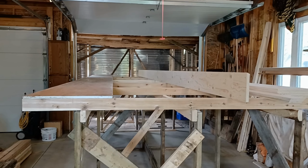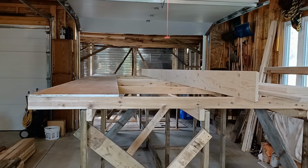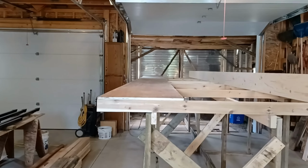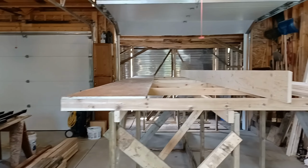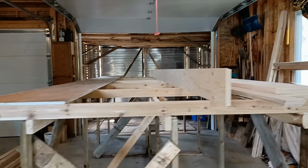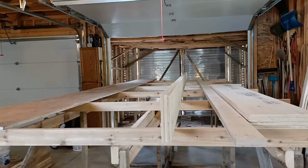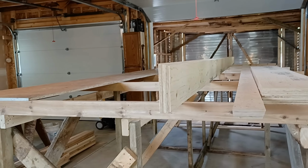Well, I'm actually in houseboat building mode, early stages. So I've set up a table on top of this support structure I've built, and I've got a couple of the stringers made. There are 2 layers of 3/4 inch plywood laminated together, glued and screwed.